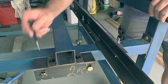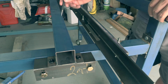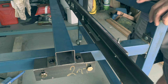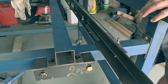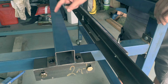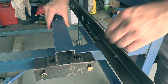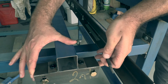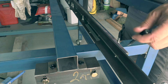So that's what we're going to do today — put in these holes and then grind off these welds because I want to reuse these plates. I've got another piece of 50 by 50 by 1.6 so I can cut that to length, but I'll cut it once I set these rails up first as a rough guide. I've got a feeling it's going to be about 1650, maybe just a touch over, so that's why I bought a 2.4 metre length. These are slotted where the screws are so I do have some movement, which will help with alignment later on.